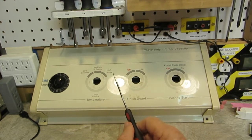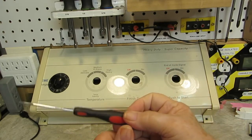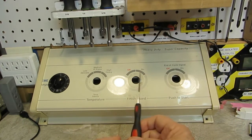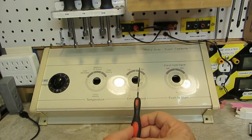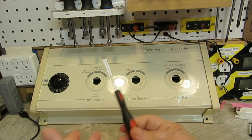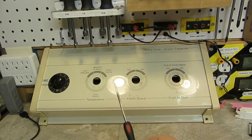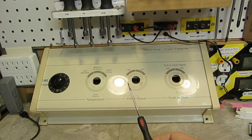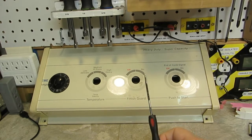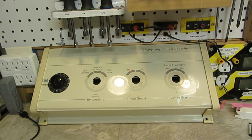I think that would be a very handy thing to have. Also — I know I forgot to tell Bob this — a frequency counter. Those little ones, I've already got one, and that could be incorporated into this very easily as well. It could also be switchable to be used as the frequency indicator for the RF generator and also as a standalone frequency counter. Very easy to add a switch to it. So if you had all that in one unit, that would just about do you for working on most things — all radios, and even most other things. You could put your RF generator to go wherever you want to go with it.